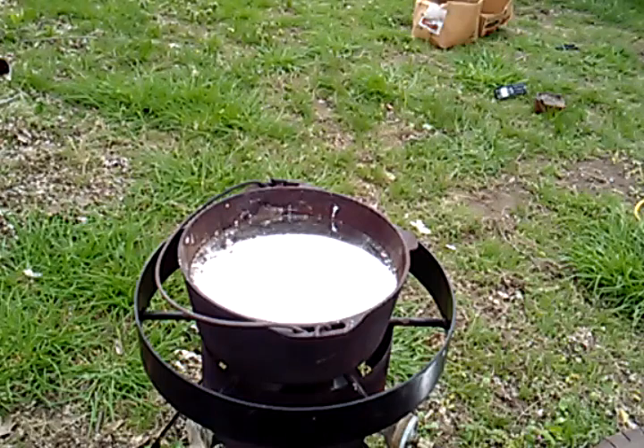I'm also not going to get through this pot pouring ingots. If you're going to be doing lots of lead smelting or large batches, I'd recommend getting two separate ingot molds, because after the first two or three pours your mold heats up so much that it takes a while to cool. If you have two sets of molds you can dump one while it's cooling and fill the other. Or you can just sit around and wait for it to cool. Most of you are probably going to do 20, 30, 40 pounds at a time, so it's really not going to make that much difference.